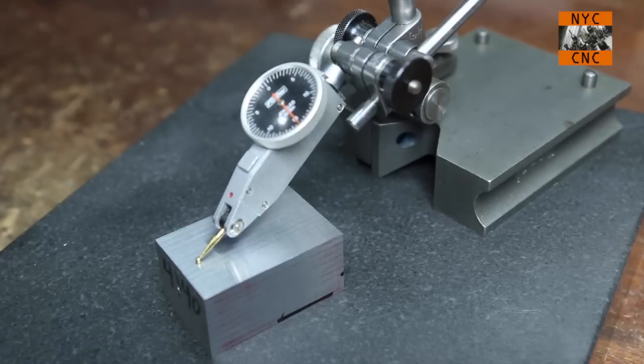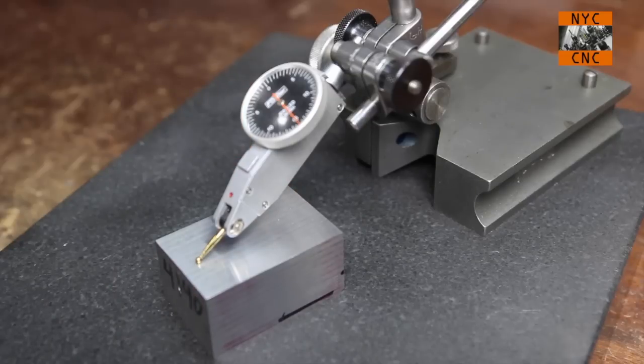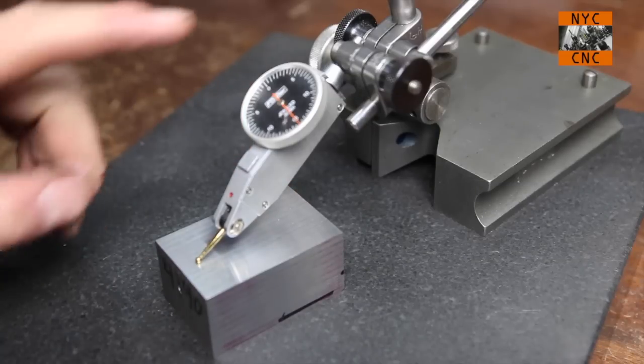So that's my experience with grinding so far. Really happy, really love it. Something I need to work on now is taking things like knife blanks or other thinner parts that have some flex in it and grinding out the flex. That's a little bit trickier to do. Working with big hunks of metal like this, you don't have to deal with warpage from the chuck. So much more to learn, but thought you guys would enjoy that.